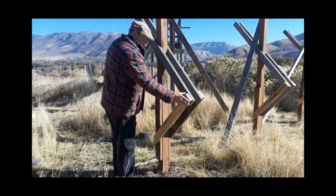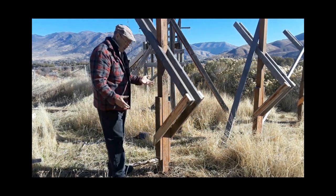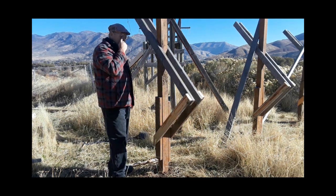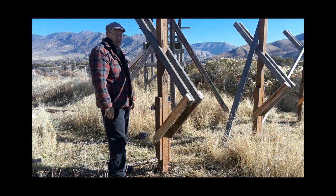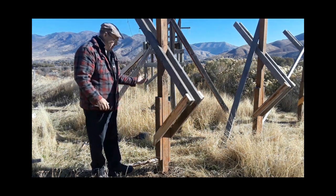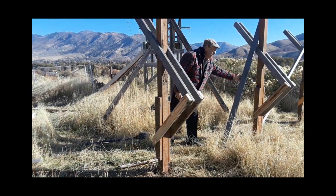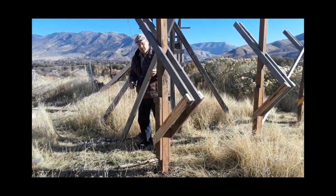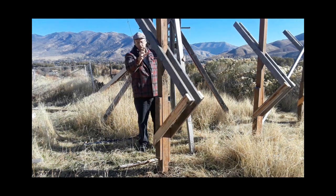The reason for these cross-pieces is to brace the posts so that they don't move. The wind direction here is from the south, and generally when we get high winds they come from the south. So I'm going to brace the back end — I'll bury a pole back here and fasten it on so that it braces this from moving that way.